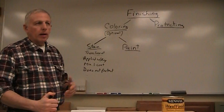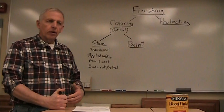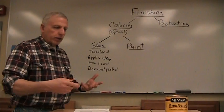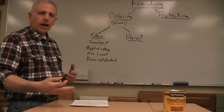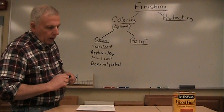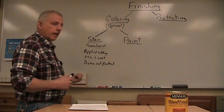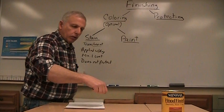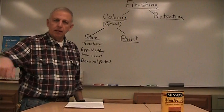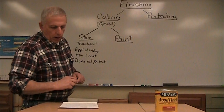You might say your parents stain their deck every other summer and that makes water bead up and protects the wood. That's true, but what they're putting on is not just stain - it's a wood preservative with a stain mixed in. So it's two products in the same can. Regular plain stain is just going to change the color. The stain has to dry overnight before adding polyurethane. Do not put polyurethane on top of wet stain because the stain will get into the polyurethane, tinting it.